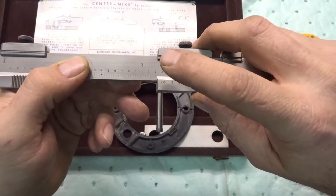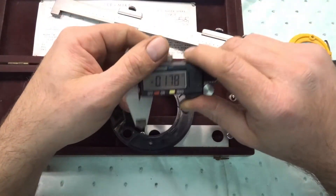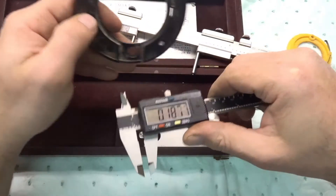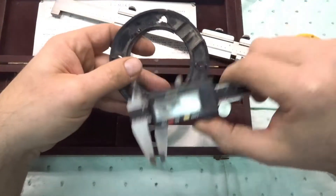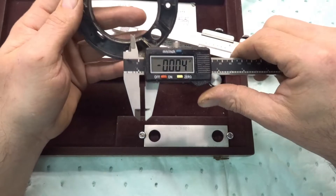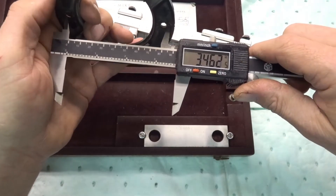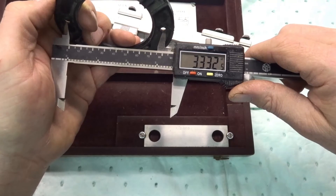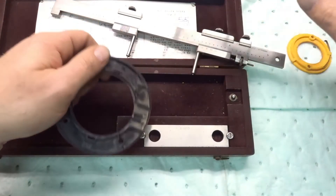So that would be three point three three one according to this tool. Now if we do our digital caliper measurements just like I showed before — let's pick a hole — it's reading 190, 178. The problem is this piece is all cracked, so I'm just trying to get a rough idea of the center-to-center distance. It's difficult with these because the points like to fall into the crack, but it's reading three point three three, three point three two, three point three five, three point three four — pretty much the same thing, which is a good sign.